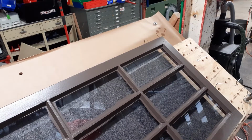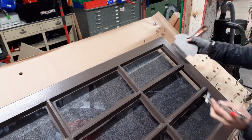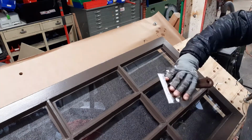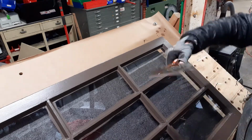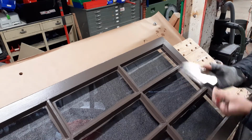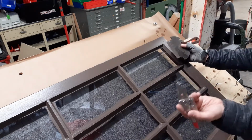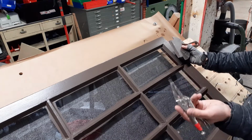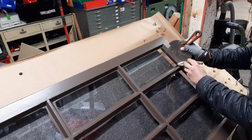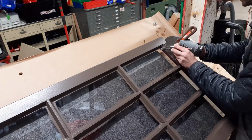So when I do this, I'll do it one knife at a time. By one knife at a time, I mean using one tape knife at a time. And I will hold it like so, so I have a good grip on it. I don't hold it by the handle. It's a little awkward. And sometimes if I have to fine tune things to get to the corners, I'll use 2 hands. So I'll hold it like this. Putty knife, kind of hold it like so, almost like a pair of chopsticks, but wider. Well, there's a new challenge: cut paint with chopsticks. And see how I do that? I keep my blade in place, if I can, and I go at the corner.